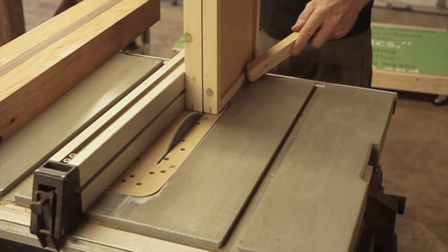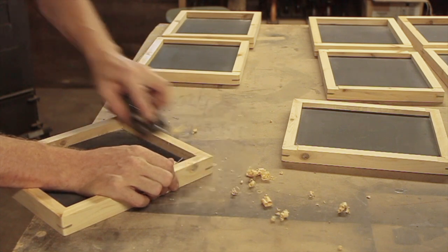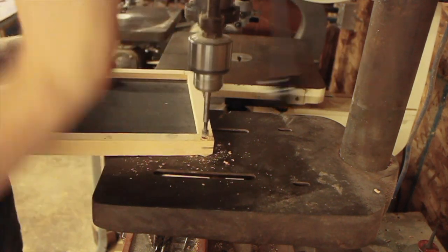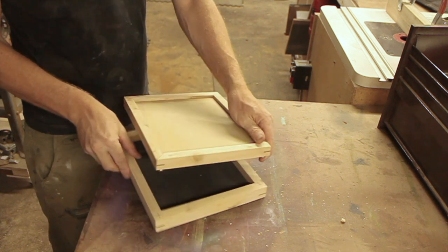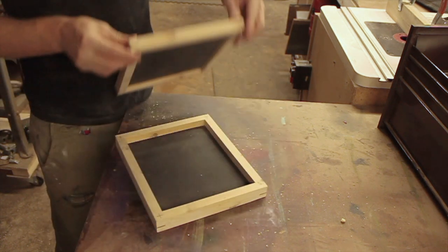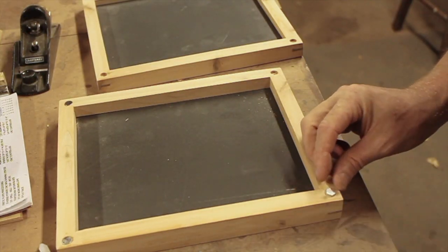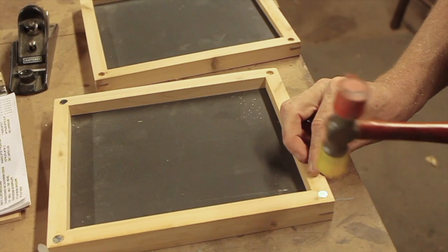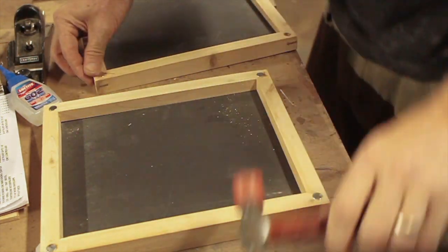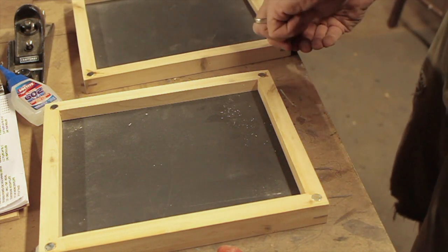Then I just cut the box open so we can actually access the inside. That's chalk paint on most of them. I was going to put hinges and a latch but I really like magnets, so I drilled holes and got these quarter-inch rare earth magnets that are pretty strong. I used my hole-center punch bits to find the center, lined it up, and put magnets on the other side. A little super glue pops them in, but you have to be careful that all the magnets are facing the right direction so they don't repel — you want a nice strong seal.